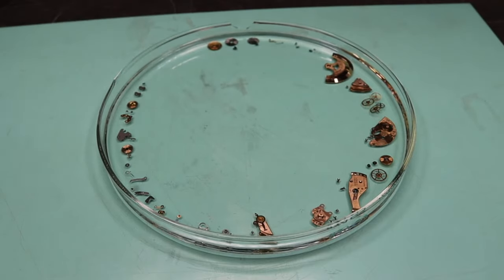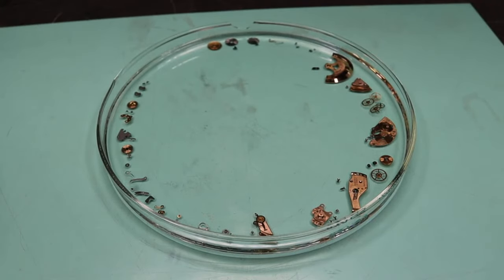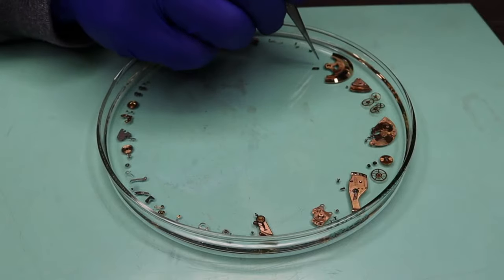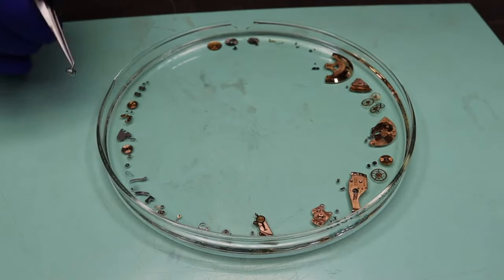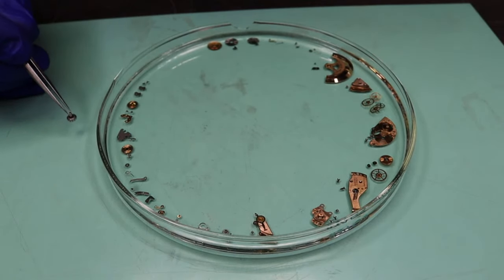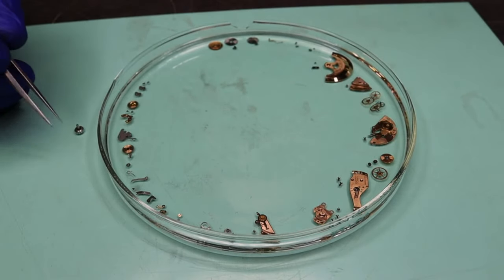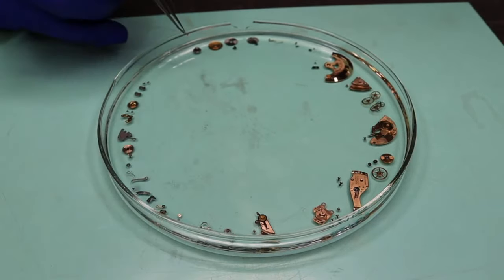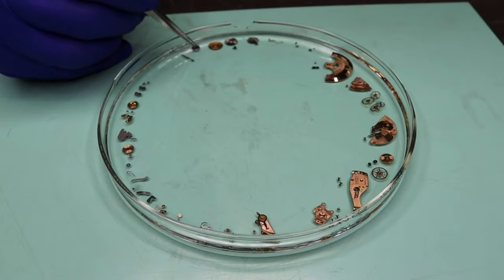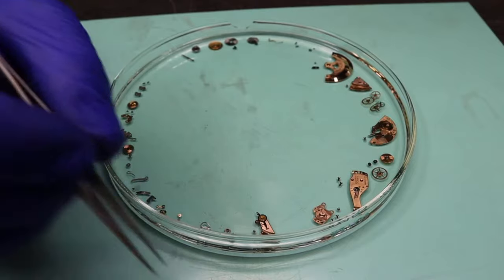Here's the movement braces. And then the locking nub, whatever you want to call it, the locking part to the rotor and screw. Okay. Pain in the ass is gonna get this gasket out of this crown. I will put the crown in here for now. We can get the gasket out. And then the stem. Actually, it's already in here. Let's remove the mainspring from the barrel.